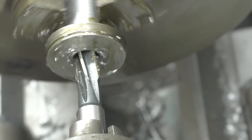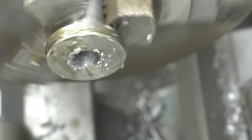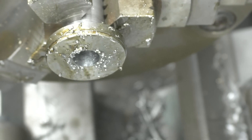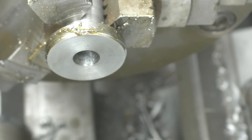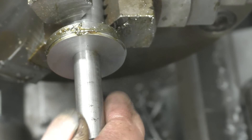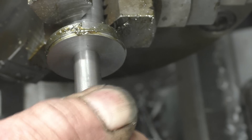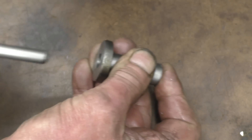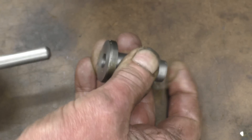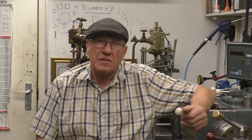The reamer has to go all the way through the job. So now the 10mm roll pin is an absolute spot-on fit in there — and we would say that's just the dog's bollocks. It's what you call a pop fit — it makes a little popping noise. I hope you picked up one or two little tips from that short demonstration of how you drill holes on a lathe. Anyway, thanks for watching.